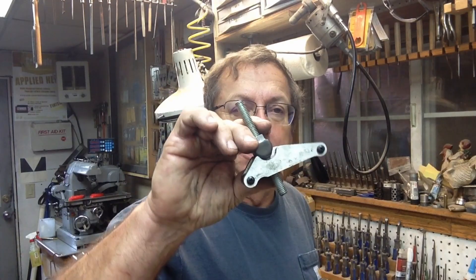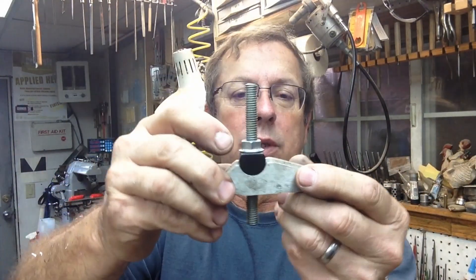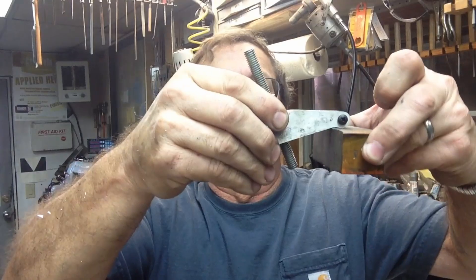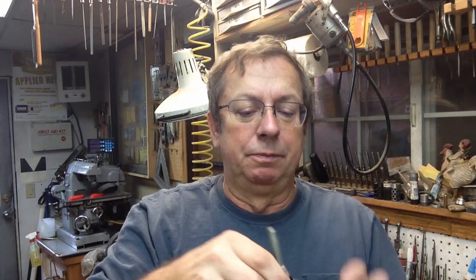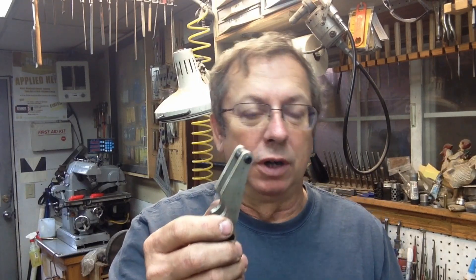Several years ago, I built a little hold-down clamp like this. This is the body of them. You mount your stud in between — whether it's a stud or a bolt going down through. If you've got something that you want to clamp from an angle, you can clamp it like here. Anyway, I built these several years ago. It's kind of a cute little system. I don't remember where the plans were published. I built three or four of them. Now I've utilized these a little bit on the milling machine, but I haven't used them a whole lot because they're not really sized the way I want them.